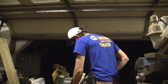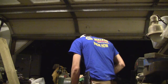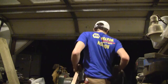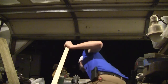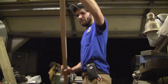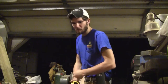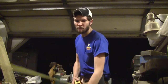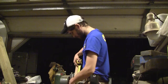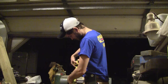Now that my board is the correct rough thickness, I'm going to go ahead and cut it to length. I could do this all in one full swoop, cut it 66 inches long with one cut. But in my particular case, my grain gets a little bit wonky towards each end of the board. So what I'm going to do is come up a few inches from one end and make a cut where the grain starts to get better. Then I'm going to flip the board around, measure my 66 inch length, and make a second cut, so the grain is running nice and straight up and down throughout the entire length of the bow.